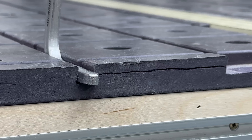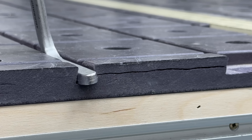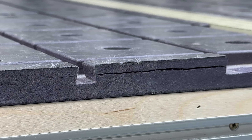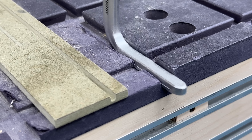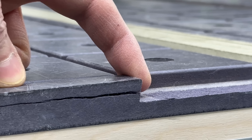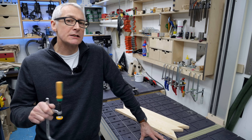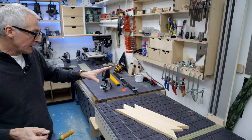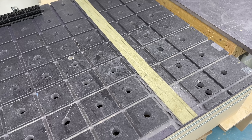One of the other issues is to do with the dovetail shape itself. Although the dovetail shape gives more clamping pressure, the problem is that it also supplies a remarkable amount of leverage sideways. I did catch this clamp a couple of times on this part of the bench and it just pinged these sections off. You can see here it's also started to go in this front section, and it wouldn't take much to split that off.